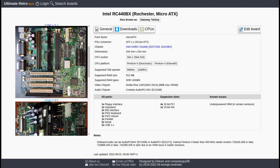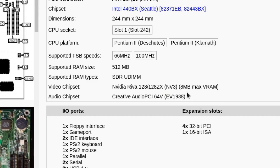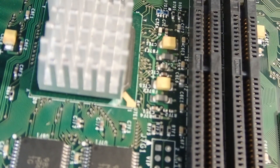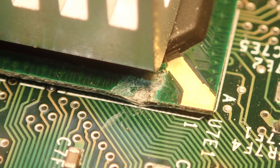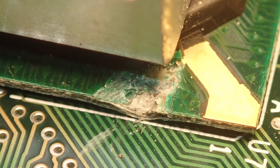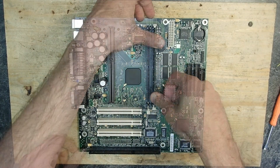In the last part I said this must be an Intel board but wasn't sure of the exact model, and I didn't know which graphics chip is used. Here you go — it is an Nvidia Riva 128 ZX, documented to have up to 8 megabytes of video memory, which is exactly what's installed. Unfortunately, as I was washing the board, I discovered that somebody tried to remove the heatsink with a screwdriver and damaged the graphics chip underneath. In close-up you can clearly see damaged traces — a sad finding since this is a BGA chip and I have no equipment or experience to replace it.